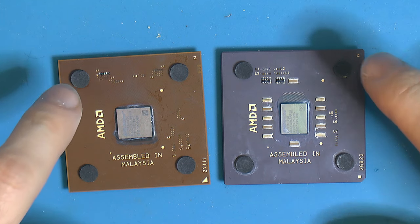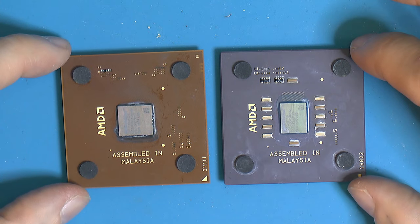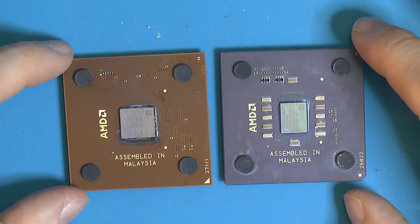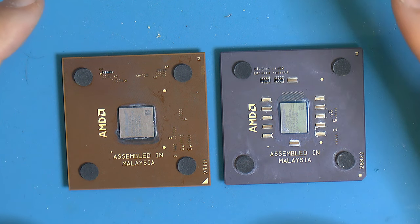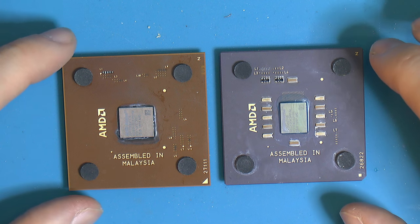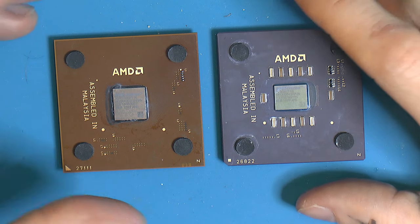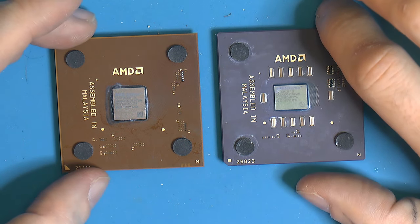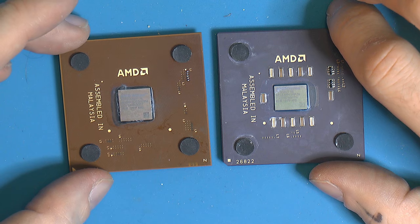So we have soldered the L1 bridges on these two CPUs because then we can change the multiplier, which is easy to demonstrate. There are other things you can change. There are guides, like you can find information on what the bridges do and so on the internet if it's something you're looking for. But this guide is mostly focused on soldering bridges, not why you want to do it really. Why I solder them is because this is gonna last. Like I showed off an Athlon 850 before, I had that for 5-6 years, it works fine still. I made two of them like 5 years ago, maybe 6 years ago. And one of them is my Millennium Era LAN rig, and it still works fine.